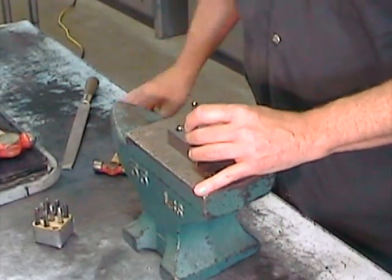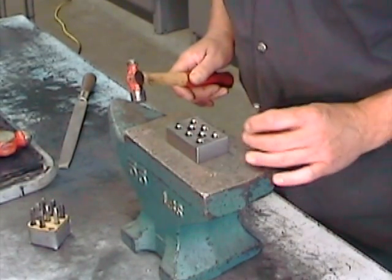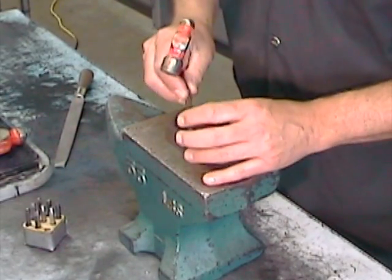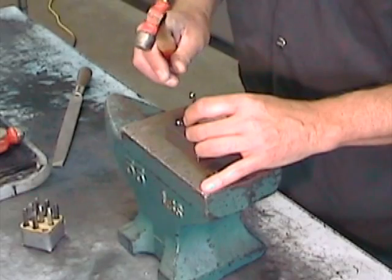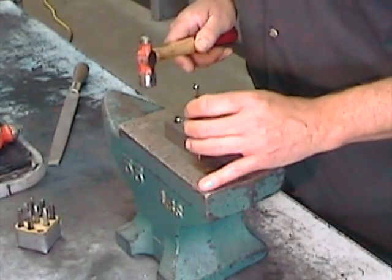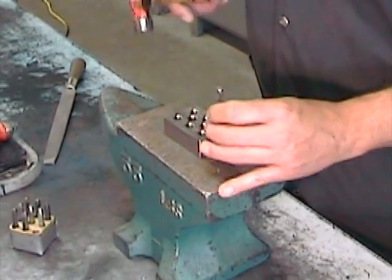This first stamping is done with a small ball peen hammer because it needs to be very light. I'm going to use this first stamping to position my letters properly. If it is just lightly stamped and one of the letters isn't well positioned, I can fix it, because a lightly punched but poorly positioned number will be erased by the final grinding.